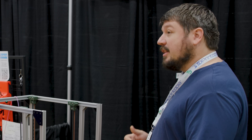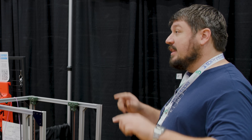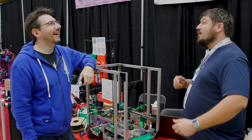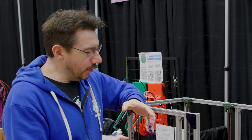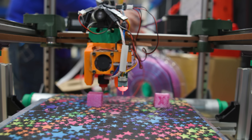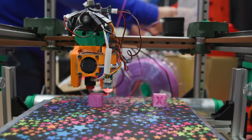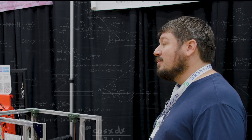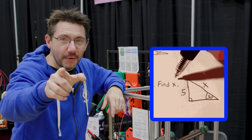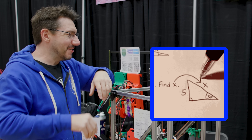The Klipper plugin is parametric, meaning that if you just give it the values of where the axles are and the offsets, it'll do the math for any size printer. So you build this any size you want, plug in a couple numbers and it's good to go. I had to brush off the high school trig because it's all triangles — the teachers say we're going to use it, and it actually happened.